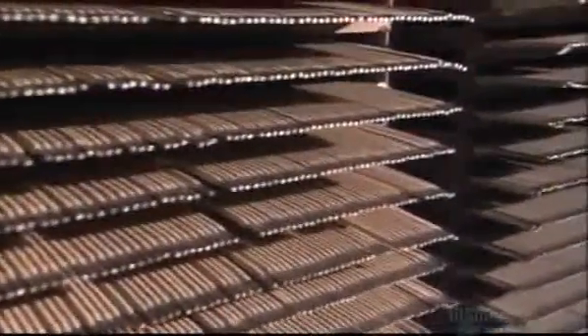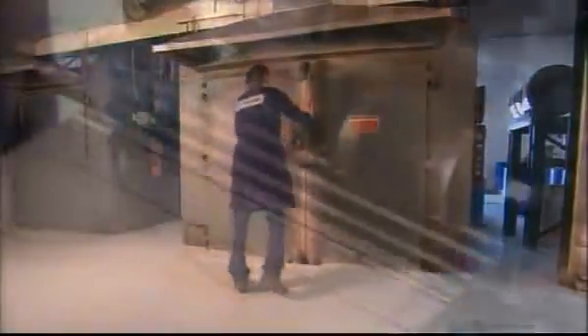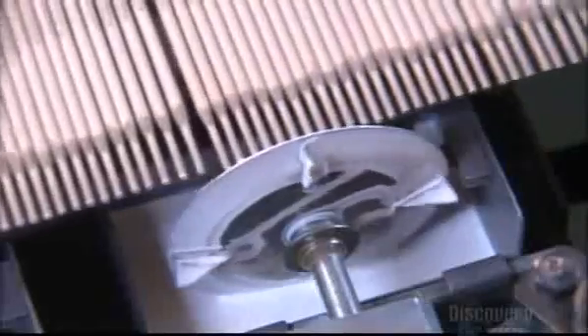The coating dries at room temperature for up to 72 hours. To cure the coating, workers put the electrodes in an oven heated to 485 degrees Celsius for up to five hours. Once they've cooled, the electrodes head into a printing press. An ink wheel first prints the model and type of current required, then another ink wheel applies a color to the gripping end — another way to differentiate the model in case the lettering on the side rubs off in storage.